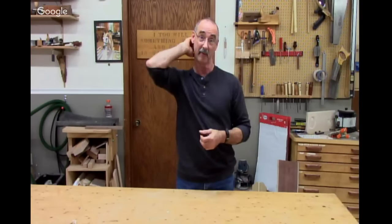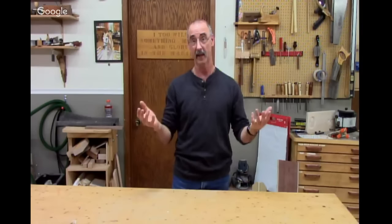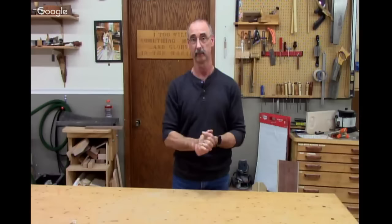Turn the clock back 150 years to when Duncan Phyfe was building beautiful dining room sets — all of that stuff was air-dried. The thing you've got to pay attention to if you're starting with that higher initial moisture content is that seasonally the wood is going to expand and contract a lot more, and as long as you allow for that, you're going to be okay. There's no real reason to say don't use air-dried — there's just some stuff you've got to know.